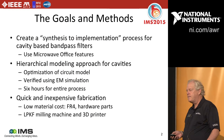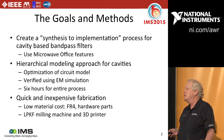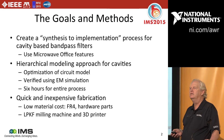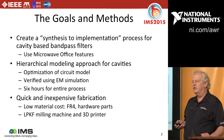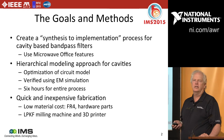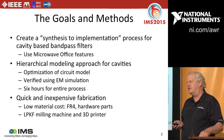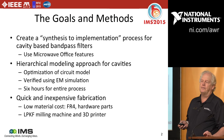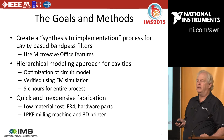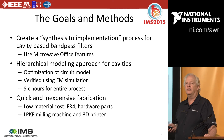The fun thing about this project is not that any one step was the most novel thing ever created. What's really neat is you've got to go through about eight different things, and they were all carried out — the whole process from conception to actual manufacture and test — in Microwave Office. You actually can design a given filter and get it all synthesized and verified in electromagnetic simulation in six hours. After that you build it, and the procedure is essentially single pass: you can tune it in and you're done.